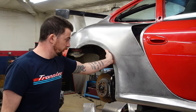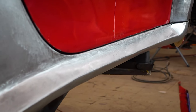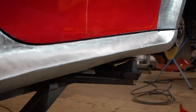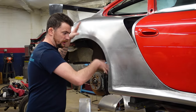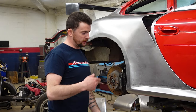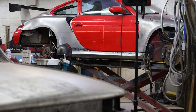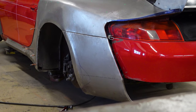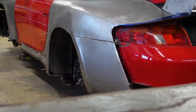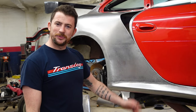This thing is super solid, and then I spent a lot of time fettling everything — hammer and dollying, sanding, hitting high spots down — so this is all pretty much ready for the next step, which will be epoxy, then some filler work, then spray poly, and then paint. In the next video you can look forward to the other side, and I also need to get the actual bumper extensions installed, which I intended to do this time but this took up all my time.